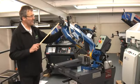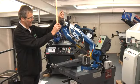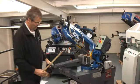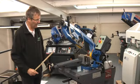Here we have the blade tensioning which is on the gauge so you can get the tension exactly right, using this handle here. Down here we have the quick lock device — you can turn it here and quick lock it for repetition.